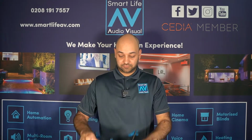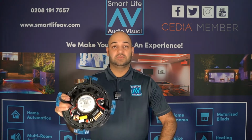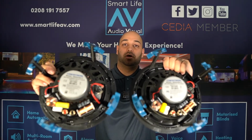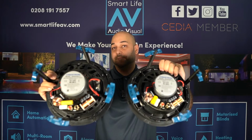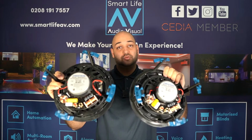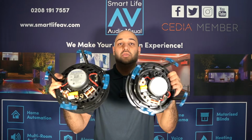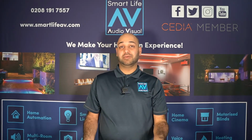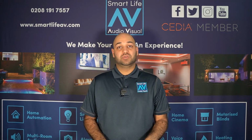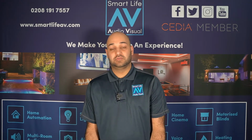Electronically, you can see from the back that both of these speakers have very high quality electronics, but from the spec sheet you will notice that whilst Origin speakers are developed with a resistance of 6 ohms, these Crestron speakers are developed with a resistance of 8 ohms, which means that the circuitry is fundamentally different. This is not a rebadged product. It may use some of the same materials, but they are actually different speakers.